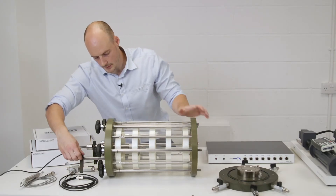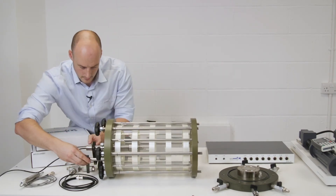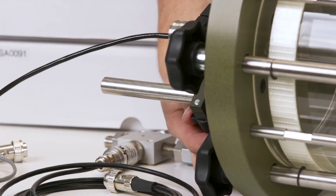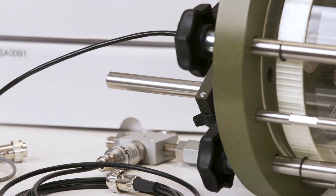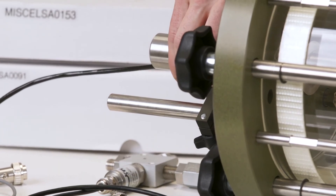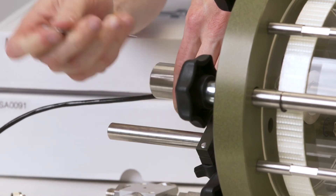Before lifting up the cell, we need to refit the support bar. This will stop the RAM falling down again when we lift the cell up under its own gravity. We can apply the load RAM cap now, or again once it's upright, just by tightening the Allen key screw on the end.